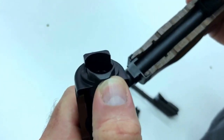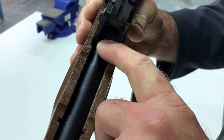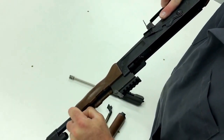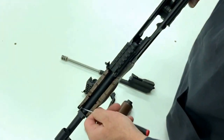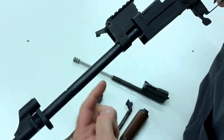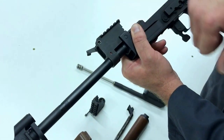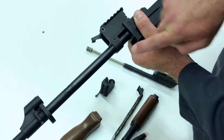Note that there is a tang on the gas tube, and there is a complementary notch — or keyway — called the gas tube keyway. The lower handguard wraps around the bottom of the rear sight tower. The rear sight tower is press fit onto the barrel and then there is a four and a half millimeter pin — in the case of this gun, the milled Century C39 V2. So there's the barrel pin and that's the barrel hole.